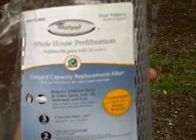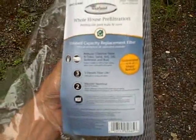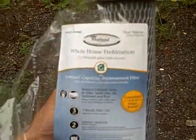With this filter, while letting it settle for a week and draining all the animal fat off the bottom, one of these filters will last well over 150 gallons. When it starts getting slow, you can replace the filter and your pumping speed will come back.